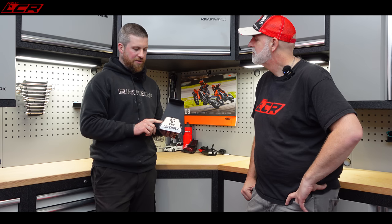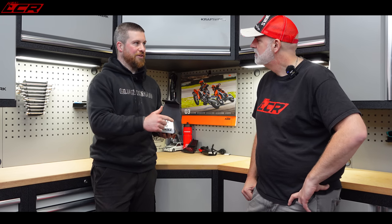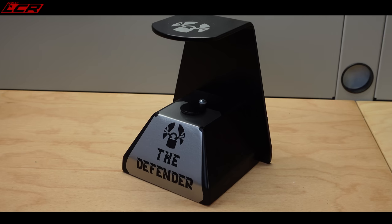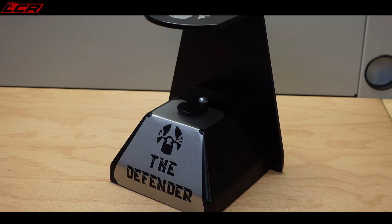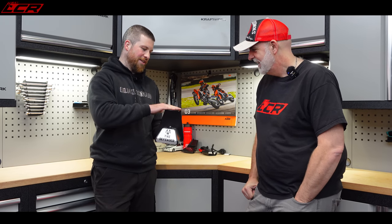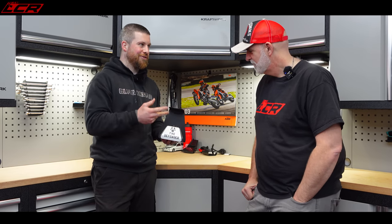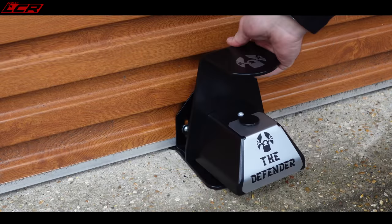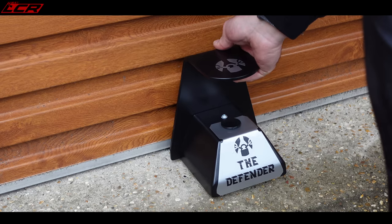The way of designing the defender is so that the distance from the outer skin of the defender at any point to the centre locking pin is greater than a grinder disc, so you can't actually cut from the outside to that centre locking pin. That's how we design our products — with the grinder in mind. And then you've got the cowl over the top which does two things: stops anybody from being able to drill and attack the lock, and it also acts as a handy handle for moving the defender in and out.